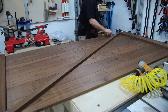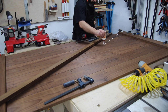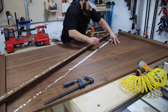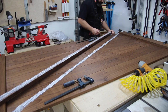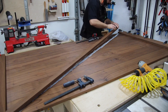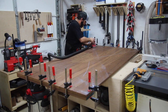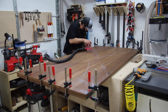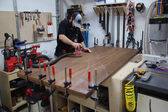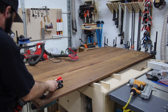For the diagonal piece, I clamped it in place and struck a line with a pencil on both sides so I knew exactly where the glue would go. I put glue on the diagonal piece and between the lines on the door, then clamped it back in place. I didn't get footage of this, but I turned the door over once clamped and pulled a chalk line where the diagonal piece is so I'd know where to shoot brad nails. Then I cleaned it up with a sander and got it ready for finish.